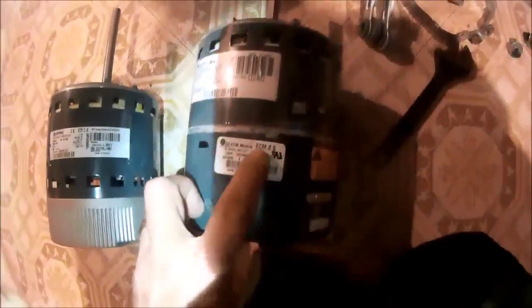All right, let me get this blower motor in. Okay, there's been a motor upgrade for this furnace. ECM 2.5, and this is 3.0, and the connections are different, and they do give you a harness to change it over to this connection right here. Here's your high voltage power. That harness stays the same, and then here's your communicating, which changes from this 16 pin to 4 pin. So there is a harness for that. It's in the box.